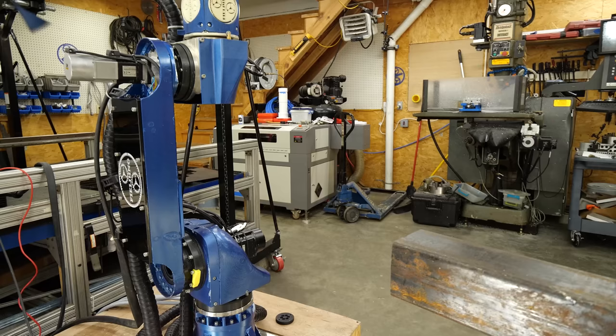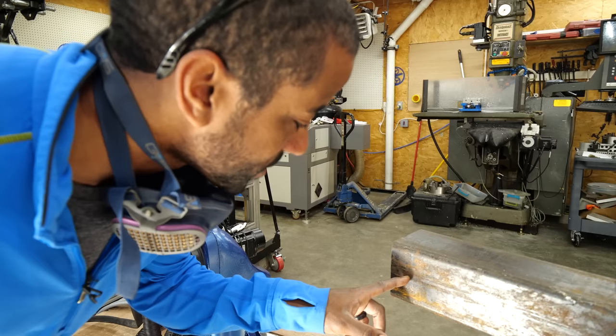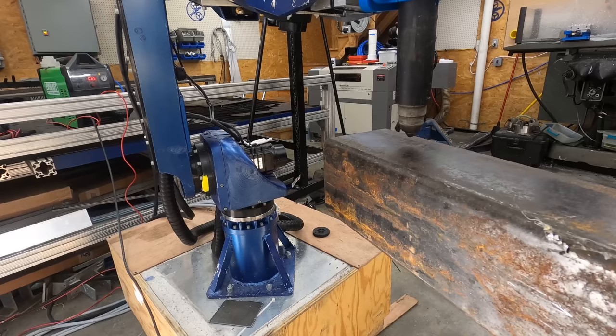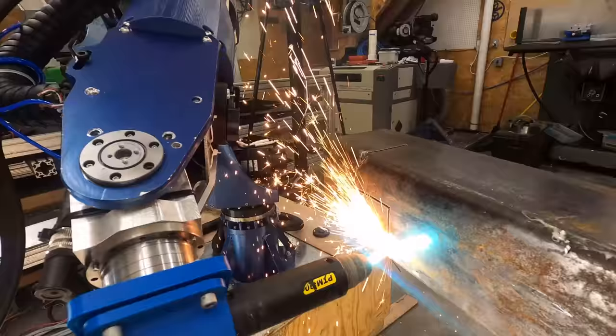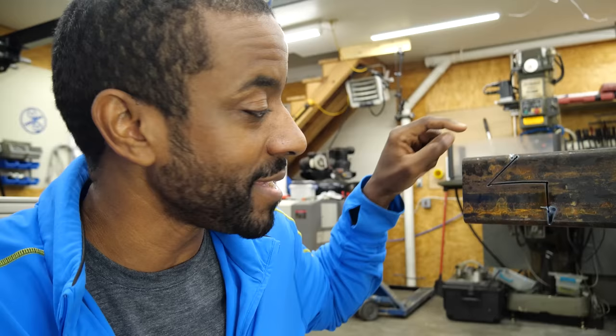Let's see if my hypothesis is correct — we'll watch the whole program all the way through, and then we'll fire the torch. I can already see the torch is going to drag on the part for a couple seconds here, but this tip is already destroyed anyway. I just want to confirm that the issue is with the linear moves. These are all joint moves, so they're not going to be perfectly straight lines. Well, there's good news and bad news. Looking at this cut, it turned out pretty much exactly how I expected if everything was functioning properly. This little offset is an error in programming, and this other problem is me being a little too slow turning the torch on and off.